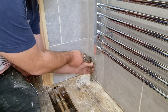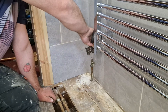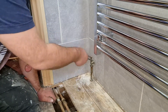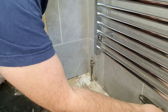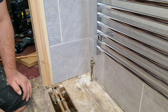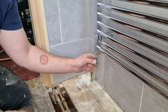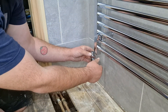We've drained the system. I'm just gonna let the air out. With your spanner, just open the valve — the original valve. This is where the old radiator used to be. Open the other one. Let's give that a couple of minutes. Whilst that is draining, I'm gonna get your valve. This is a tail — this goes inside the radiator and then your valve fastens onto it.